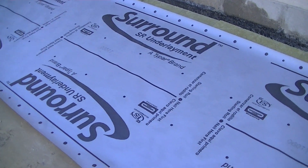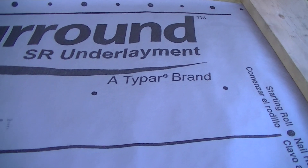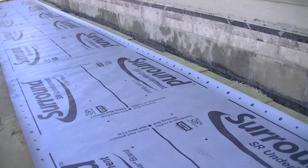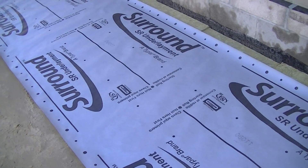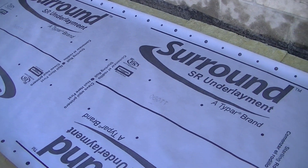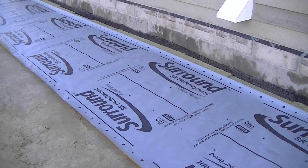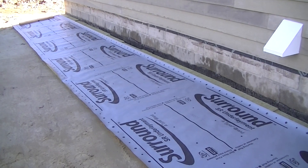It's designed for roofing underlayment. It's very similar to a Tyvek-type material — this says Typar brand on it, so it's probably made by them. It's something that's not going to last forever, I know that, but I was able to get a roll to try it out as a sample, so I'm going to see how long it lasts in this application. The primary purpose here is insulating the ground, so I'm not so worried about water intrusion. If water shedding were the primary purpose, I would have used an EPDM rubber. But this should hold up for a few years at least.